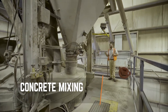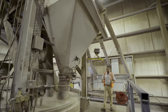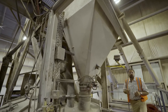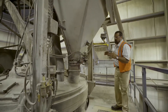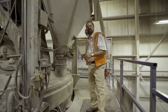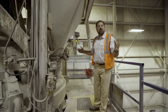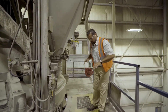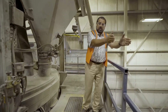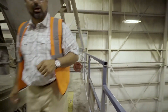Overhead, you see the silos feeding cement into our planetary mixers. We're air blowing Granupin iron oxide pigment in here as well. Our sand, our aggregate — all mixed together before water's even added. Once that's done, I can feed into one of three hoppers a specific color to whatever blend I'm making, feed it below into three separate conveyors, which will eventually feed the machine that's going to make the block that we're famous for. Let's take a look.